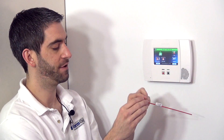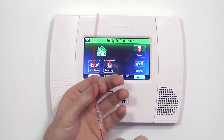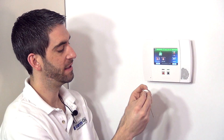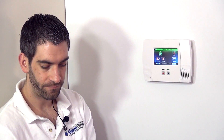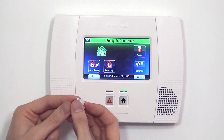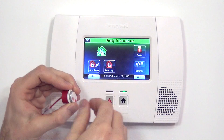This unit consists of three pieces. You have your contact, which includes your circuit board, your battery connector, and then this red length here is your antenna — your wireless antenna for the device. It's got a little end cap so that once the battery is installed, it holds into place. And then it has the corresponding magnet which, when the door or the window is closed, would be in line with the contact, keeping the zone happy and the sensor ready to go.